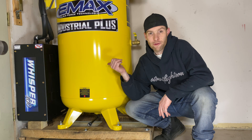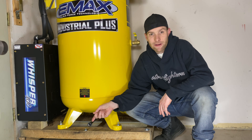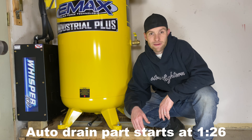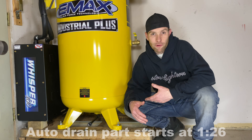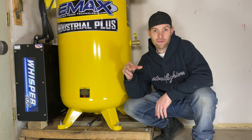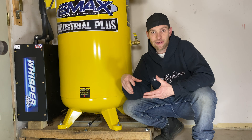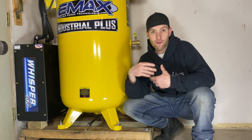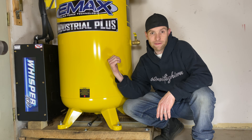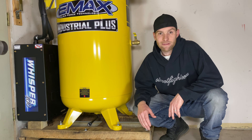Unfortunately, air compressors can get water inside them, which is why you have a drain at the bottom of the tank. That's because there's moisture in the air, which is humidity. Hot air generally carries more moisture, and as the air is going through these super hot pumps up top and through all these little tiny orifices, they also create friction and it gets even hotter. So the more the pump runs, the hotter the air gets, and the more moisture you'll get inside your tank and through the lines.